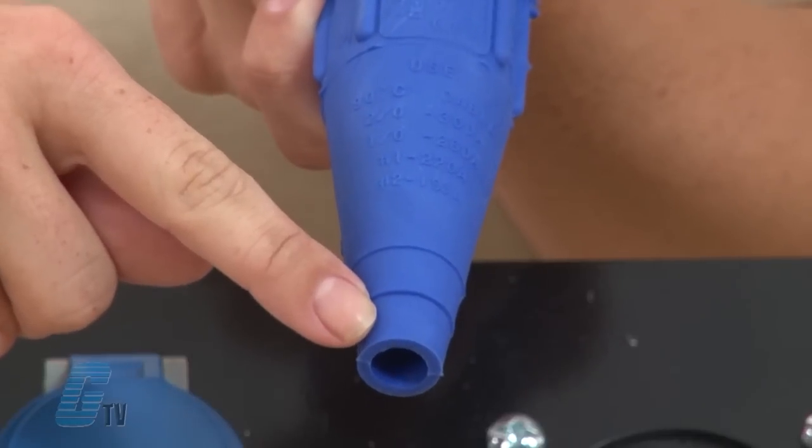Exclusive to the E-1016 and the E-Z-1016 plugs is a high-strength molded, in-place locking ring to secure the insulator to the contact. The recessed contacts are protected by an insulating jacket that extends beyond contact ends for safety. The locked contacts can withstand a pulling force of 1,000 pounds.